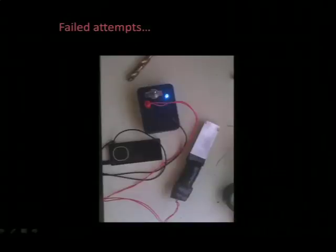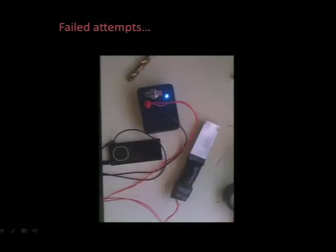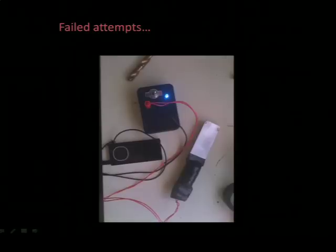Progress is never really made without a few failures along the way. In my attempt to come up with a Terminator 2-esque hack, I made this little device. It's basically an electromagnet wired up to an amp, which is connected to a media player. You create a WAV file which is designed to simulate the data on a magnetic stripe. You plug the electromagnet into the ATM, flick the switch, play the WAV file, and the ATM will think a magnetic stripe is being read. Technically it works fine, but it was actually bugger all help.